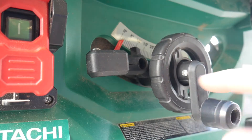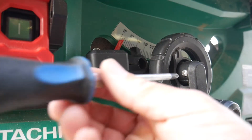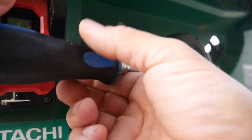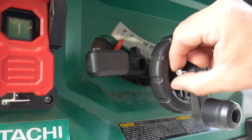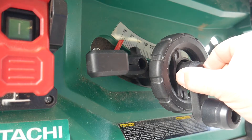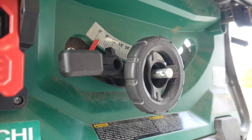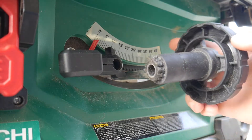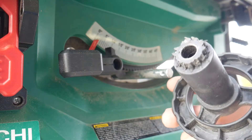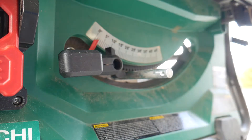The first thing to do is to remove this screw right here. This is a Phillips head screw, so use a screwdriver. Once the screw's out, you can pull this crank out right here and then you could remove the rotation wheel. As you can see here, my gear is really stripped, so I'm going to replace that.